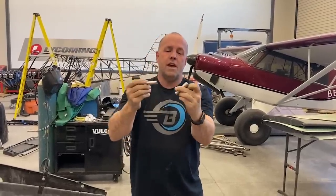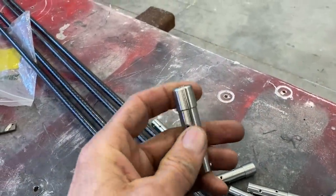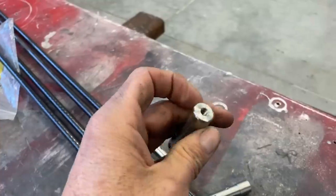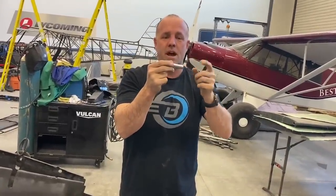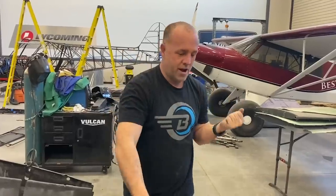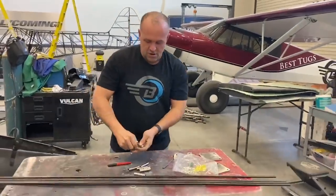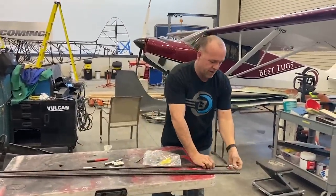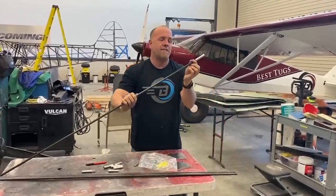So the other end, I machined this one, so these are parts I just made up. This one just has threads on the end that I can put in an eyelet with a pivot ball on the end, and this one I can use to spin in and out, lock nut it, and adjust the tension on my flying wire, or actually flying carbon fiber tube. So the way this works, the threads on the inside actually don't thread onto here. They're just a really tight fit.